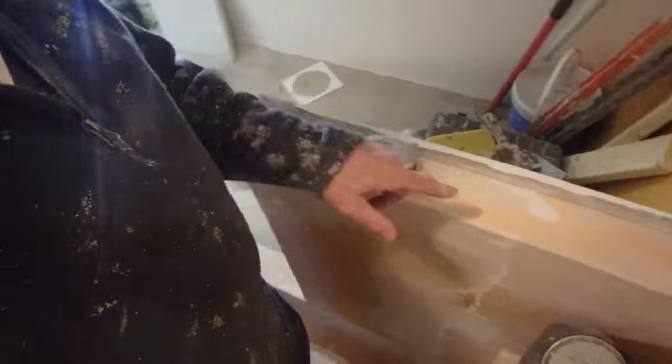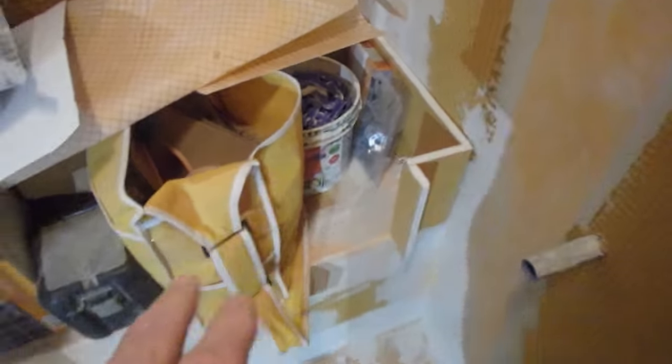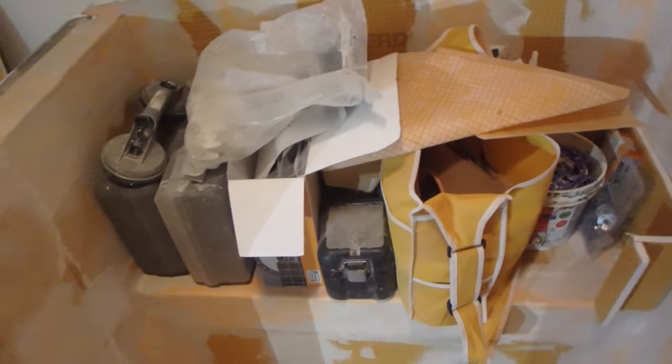If you had a 12 by 24 inch tile, for example, you would probably put one grout line in the center here, and then one grout line in the center here. And on the bench seat, you would also put a couple of tiles. They wouldn't be wide enough, so you would have to decide which way you're going to run them. These are actually going to be vertical, 36 inches the long way, so you would probably have the grout lines match with the back wall. You've got some options on how to do it with tile. You would do the layout that looks the best.